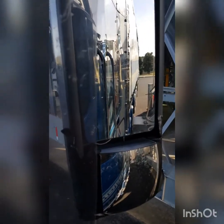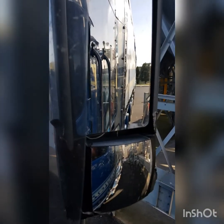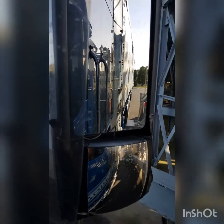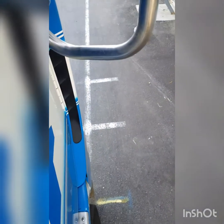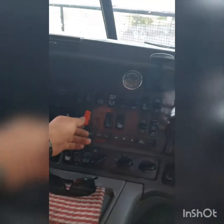We're going to drop our back unit. Now just pull away slowly, you get a click of the pin through the jaws. Okay, this one's dropped down, and look at that little mark here, see these grid lines. So I basically drop my centre cap right about there. And that puts us in direct line where we need to be. So generally from here we've got a PTO switch, clutch engaged, on, boom, done, and we're ready to roll. So that's basically turn the PTO on.